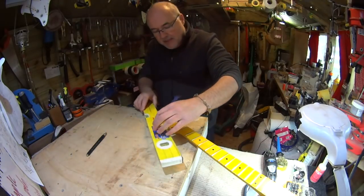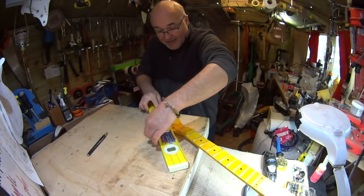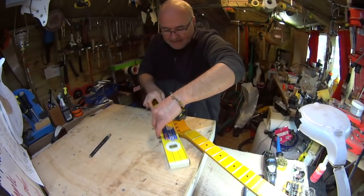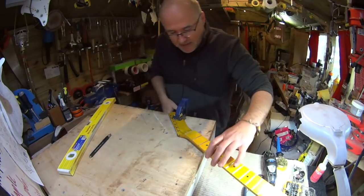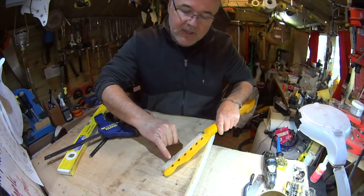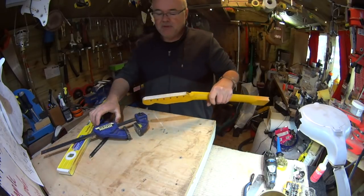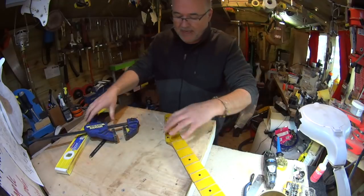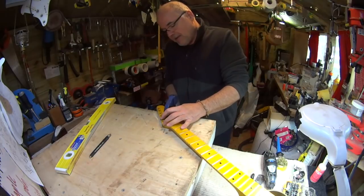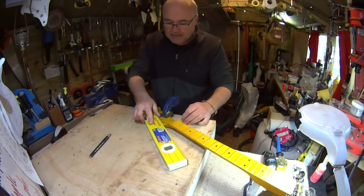They can act as leveling beams for frets if you want to do it that way, and they can do things like this because they're pretty much machined level and flat, which is great. Okay, so a quick look, you can see what we've got is a low spot here, here and here. It's telling us that if we want to get it absolutely precise, we'd want to keep on going until we level that out, and it's just a matter of time and attention. Get it positioned somewhere useful, and away you go.